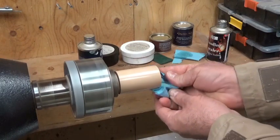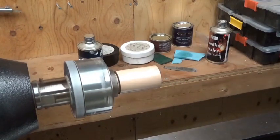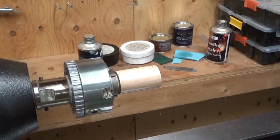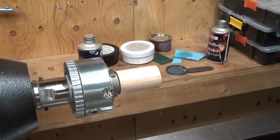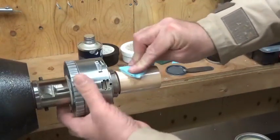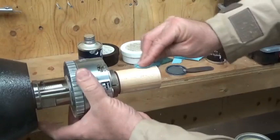And I would say that is good. Now you can see the lines of wax when they move across the surface of the wood. Keep doing this until that stops. And that is now done. And what we can do is continue to put Hampshire Sheen microcrystalline wax on, which will give you a fingerprint proof finish, some more shine and protection, essentially. You don't have to do this step, it's just one more step that I like to do. The bare minimum that I recommend is to clean it, seal it, use Yorkshire Grit Original and Hampshire Sheen High Gloss. Everything else is just an extra bonus.